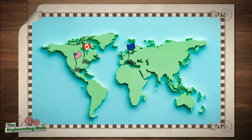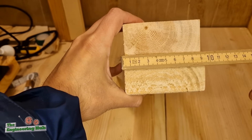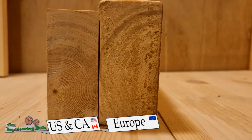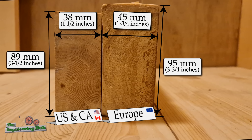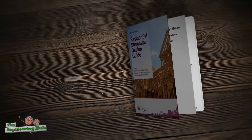This makes the analysis a bit more confusing since the species and dimensions of the 2x4 are actually different across countries. For example, in Europe the actual dimensions of a 2x4 are 1.75 x 3.75 inches, or 45 x 95 mm, whereas in North America the size is 1.5 x 3.5 inches, or 38 x 89 mm. For an explanation of this, check out my old video on 2x4 dimensions. Before I show you my tests, let's apply the US code to the European 2x4.